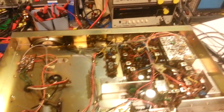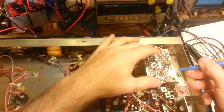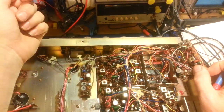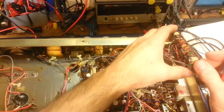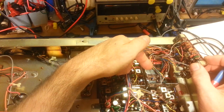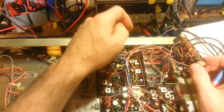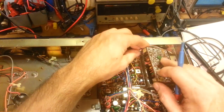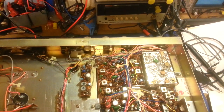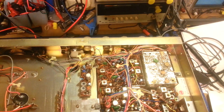You'll find this similar circuit on other radios, not just SBE, but this one is probably the most complicated one ever made in this style. That's because the Console 5 has a scan function. Normally this is just the PLL module, but when you pull this up, this side is also populated with a bunch of ICs, some of them rather large, because of that scan feature.